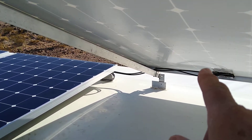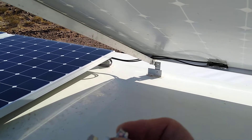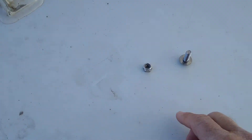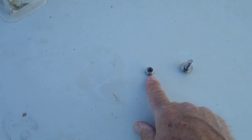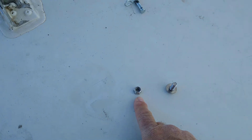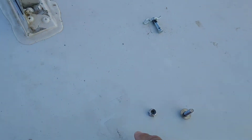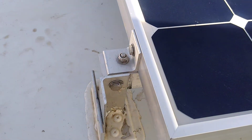What allows me to tilt them is I use stainless steel — you can see it here — I use a stainless steel nylon locking nut so that I can adjust it to the point where I can pivot the panels up for tilting. And right there is how I've attached the panel to that length of angle iron.